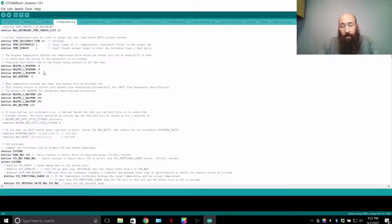So whatever. Basically what this does is if it's below the minimum temperature, your printer will say there's a minimum temp error, I'm not going to print. The way I used to get my printer to print before I switched it to -5, because it was set to 5 degrees before, I would put my hand on the heat bed, wait for it to come up above 5 degrees centigrade, and then on the hot end I would also hold it and wait for that to come up above 5 degrees centigrade. So in order to avoid all that, and the speed of having to turn on your printer, turn the knob, kick on both heaters just in time before it cools back off because everything else is still freezing.